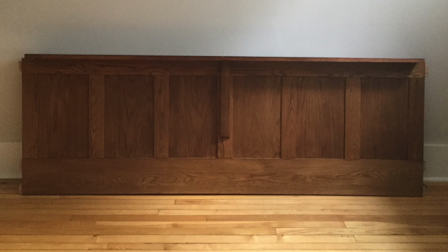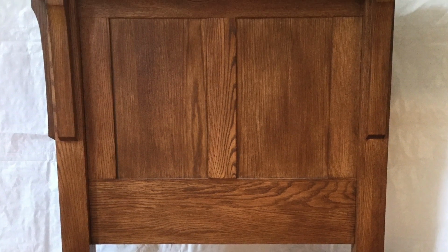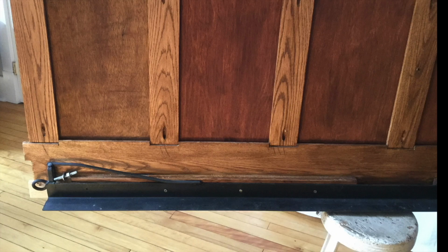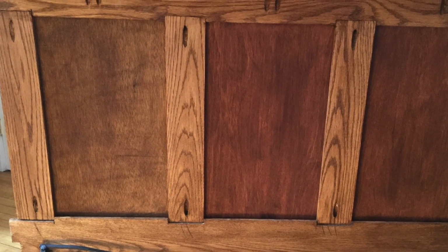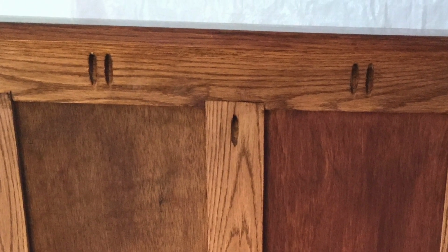Unfortunately, I built this couch before I was doing these videos, so I don't have any actual construction details to show you, but it's all basic frame and panel construction. There really isn't anything complicated about the woodworking end of it. The only shortcut I took was on the back panel, where I used pocket hole screws to assemble the whole thing. Again, I wasn't expecting anybody to see this, but everything else is traditional mortise and tenon joinery.